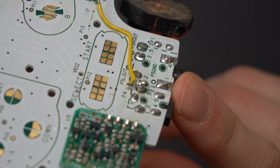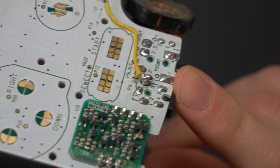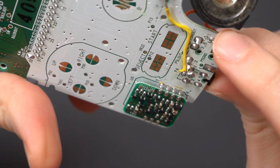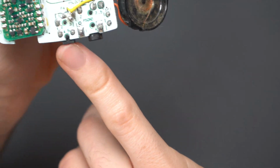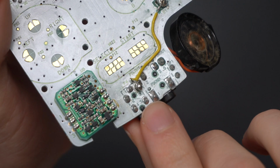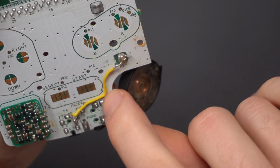And that's not me bashing them. Obviously everybody starts somewhere, but it doesn't seem right. It's almost like maybe they've not used any flux at all and they've used some dodgy solder, but I'm going to get that removed and put my own in, or try and fix it a different way. Because obviously they're bridging here from the battery negative terminal to the ground pin on the DC jack.